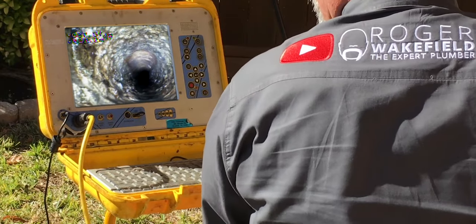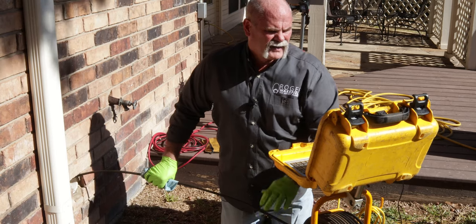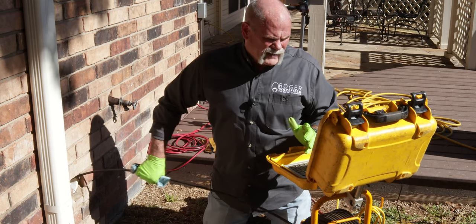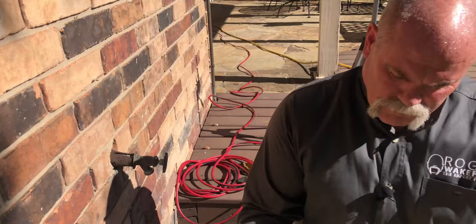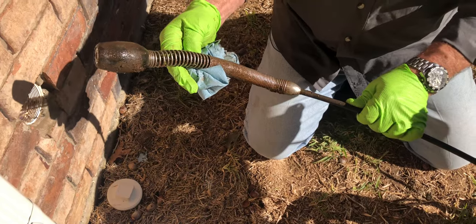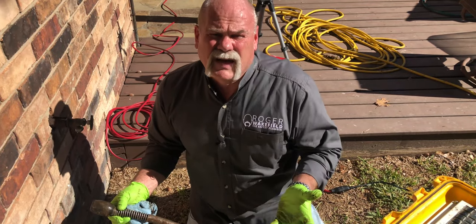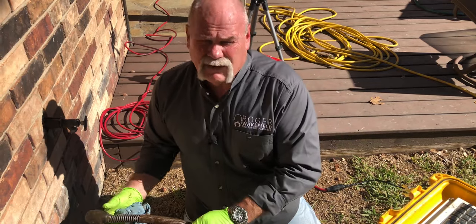As we come back in further, look at that angle — the pipe almost looks like it drops a little bit. There are roots right there, and we're only five or six feet in. There's a big buildup of them. Back in that area where I had a hard time pushing the camera through — with the roots in there, I think this is probably dirt and mud along the bottom. The mud on our camera is from years of the line being broken. This mud has built up over the years, causing lots of problems. Looking at this, I'm thinking the plumbing played a part in the foundation issues — plumbing leaks getting the mud wet, making it expand and contract, causing foundation problems.